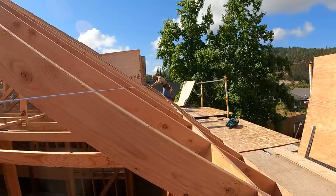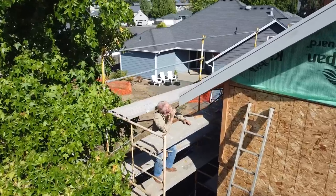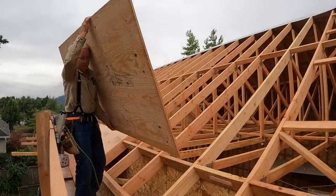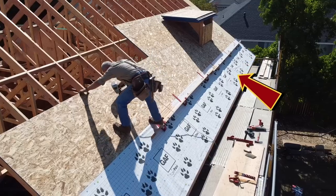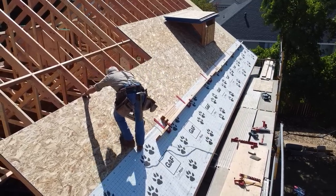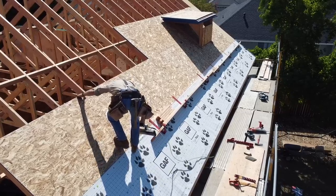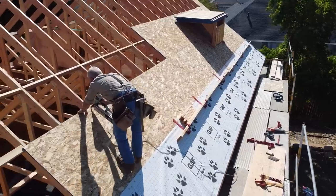In the next video in this series, this thing's going to suddenly look like a shop, because we'll be finishing the barge rafters on the front and sheeting the whole roof. Besides that, you're going to get a look at a product called Tiger Paw. It's a synthetic roofing underlayment that's nailed directly to the substrate. And I gotta tell you, just like some of you have told me in the comments on earlier videos, it's a big, big improvement over old-fashioned tar paper.